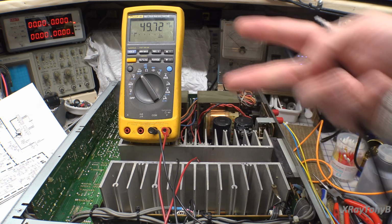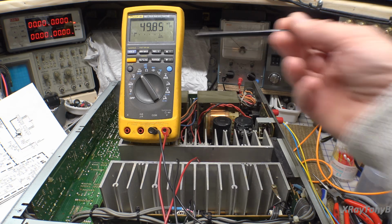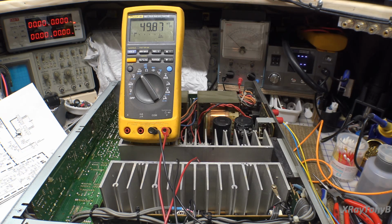So, you have quite a bit of latitude to do that. So 50 millivolts is a good starting point. The idea is follow the instructions. It's usually good. I've seen some amplifiers out there where they actually go a little bit crazy with it and they run it higher than it needs to be. Especially when you've replaced it with really good matched output transistors, you really don't need to run the bias that high. You can turn it down and it'll idle cooler. But that all comes with when you do your tests for distortion and everything to make sure that the amp is performing and doesn't have any crossover distortion, anything like that.